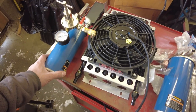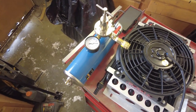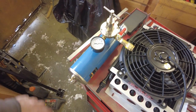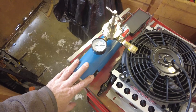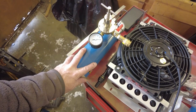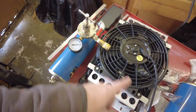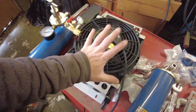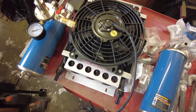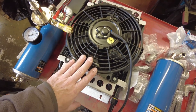The other day I got some really good deals on condenser regulator setups from Harbor Freight. They've changed their design — they've discontinued this model and gone with a little bit nicer one. These were on sale for I think like 23 bucks and I picked up four of them. Here we have our intercooler radiator. It's essentially a transmission cooler designed to handle several hundred PSI, so my compressor running at about 100 to 120 should be no problem.